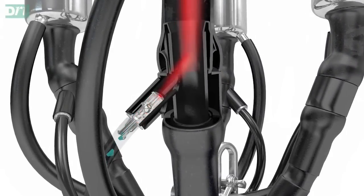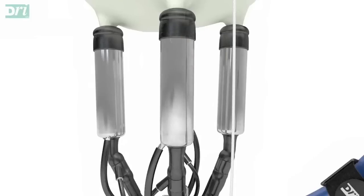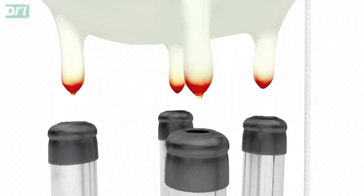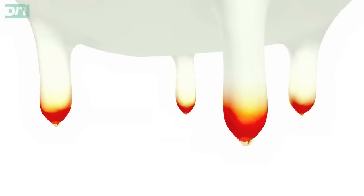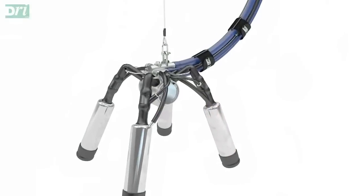The blast of air creates a fine spray of teat dip inside the injector spray nozzle that is situated in the short milk tube of the liner. The dip goes on while the teat is extended and evenly coats the teat end, while both the skin pores and the teat canal are still open and receptive to disinfectant and emollients. The teat has not been exposed to the environment prior to dipping.